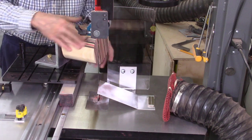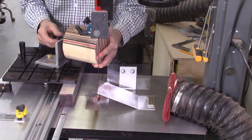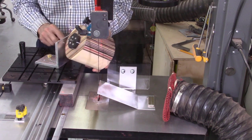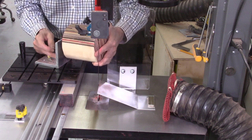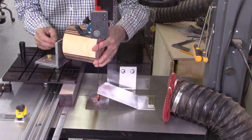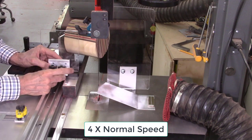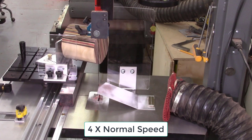So I mount my laminated block onto my Accu-Facet system. And I am using the 12 position pattern disc, and I'll be skipping a step at every layer. And I'll be using the angles of 20, 40, 60, 80, 100, and 120. I reinstalled the front safety shield and proceeded to cut the facets in the same manner as in the previous laminated block.